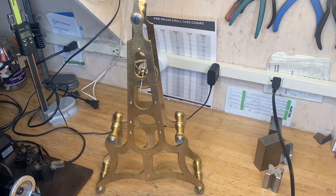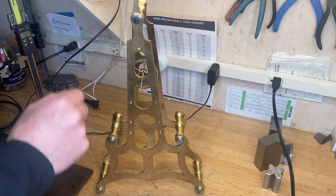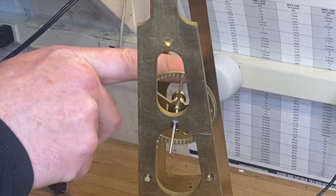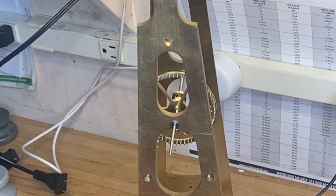What I'm going to try to show you in this video is fixing a problem. Earlier I mentioned that we had a bent arbor. This is the arbor and this is the escape wheel. When this spins, you'll see it going up and down — it's not concentric. We'll do a measurement so you can see exactly what the issue is.